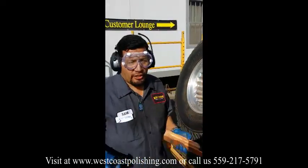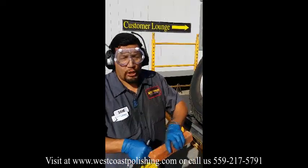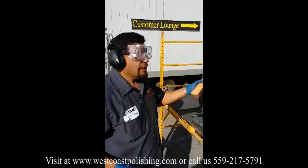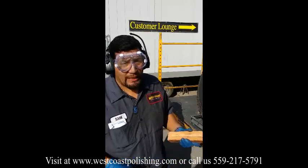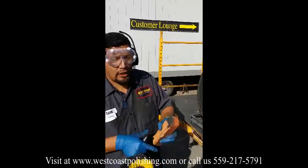Now, when you're polishing and you got a job like this, you want to load it frequently, because the minute you put that on, you got 6,000 RPMs, it doesn't take long for you to use up your cutting capabilities. That's what keeps your work progressing, is the ability for the wheel to cut. You got to load it frequently.